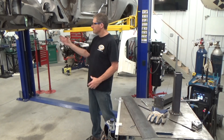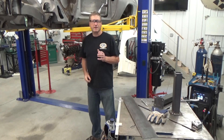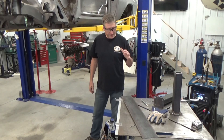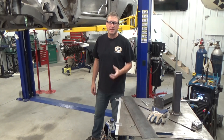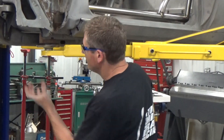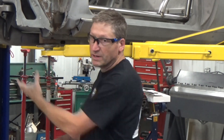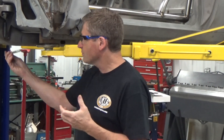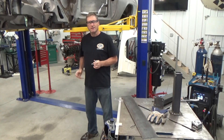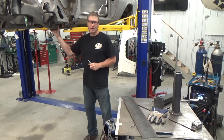I'm trying to figure out how I want to mount this to the frame. The best thing to do is take that same 3/16ths plate that I made the mounting pads out of and make a saddle that's going to go right around the frame rail. Then I'm going to drill a 7/16ths hole through both the saddle and the frame and just run a through-bolt through it - that should easily be enough to hold this to the frame.